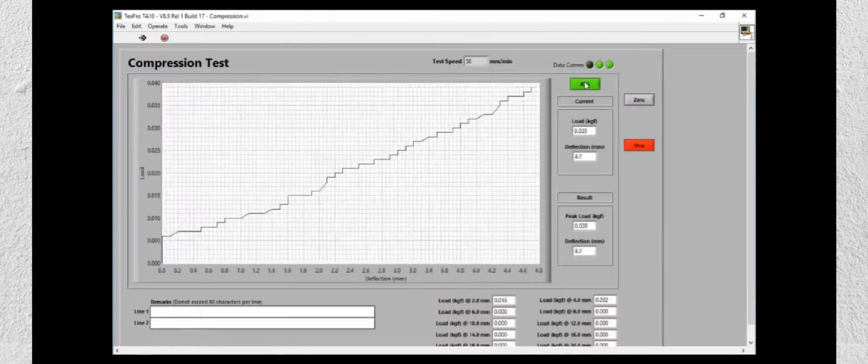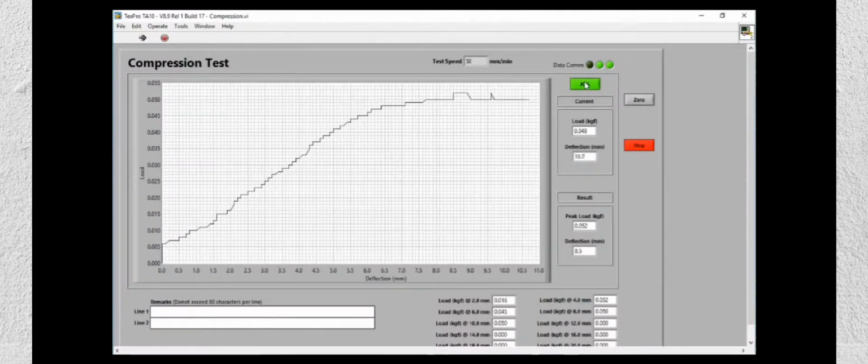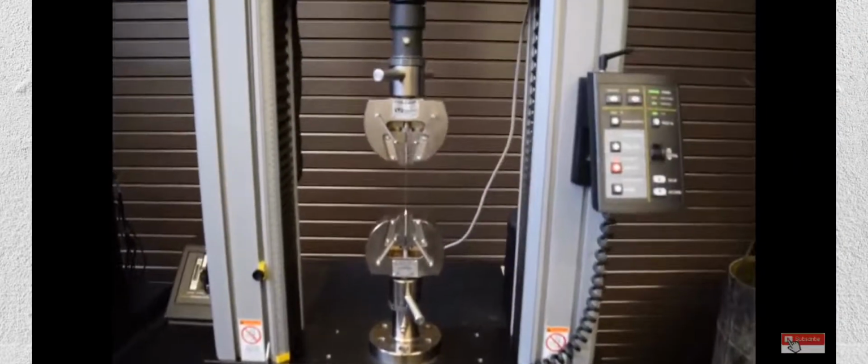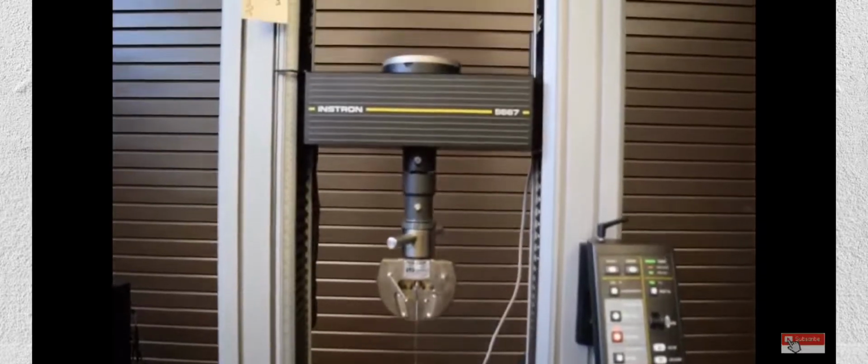In the food industry, the UTM machine is generally marketed as a texture analyzer, with some tweaks given especially for the food industry. Food texture analysis can be performed with a universal testing machine by using various fixtures available, like different varieties of blades, and different types of probes like ball probe, cylindrical probe and a conical probe, which are available in different diameters. Final results which can be obtained after performing this test are firmness, crunchiness, hardness, extendability, brittleness, gumminess, cohesiveness, stickiness and more. UTM can be used to test a wide variety of materials like concrete, steel, cables, springs, steel wires and chains, slings, links, rope, winches, steel ropes, etc.